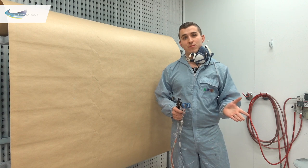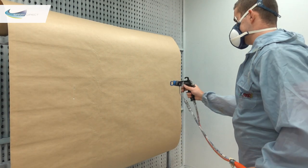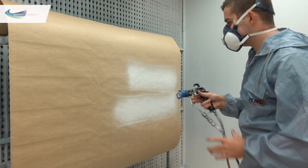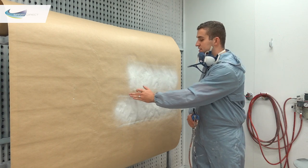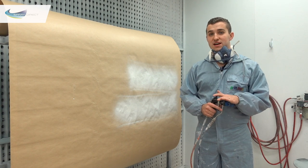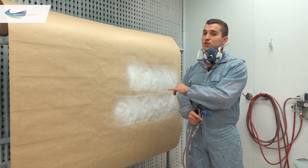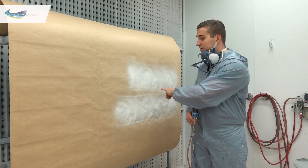As you can see we're getting some pretty heavy tail lines — obviously not acceptable for fine finish joinery work. What you would have to do with an airless unit is increase the fluid pressure, which would eventually get rid of those tails but at a much higher pressure.